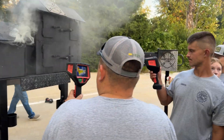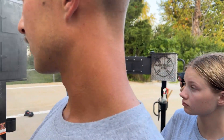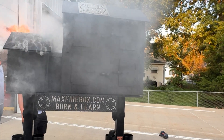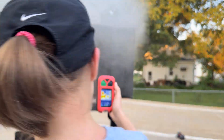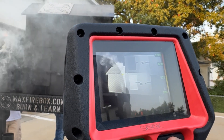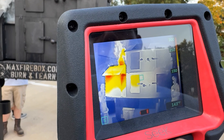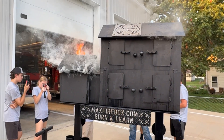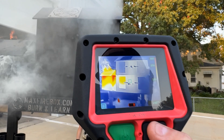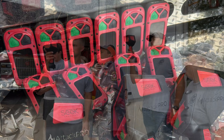Just because you got one view on it doesn't mean we're done — that thing's ever changing. Whenever you're looking through the eyes of that thermal camera, we always want to get additional information. We're not going to rely on the first thing we've seen when we get there — we're going to continuously be getting information. We're in the normal mode, we're going to switch to survey mode: hold about two seconds, one, two — go to temp mode and boom, there's survey mode. Let's show without the thermal camera — there's our view — firebox phase two burn. Now we're going to come back up and show the thermal camera in survey mode.